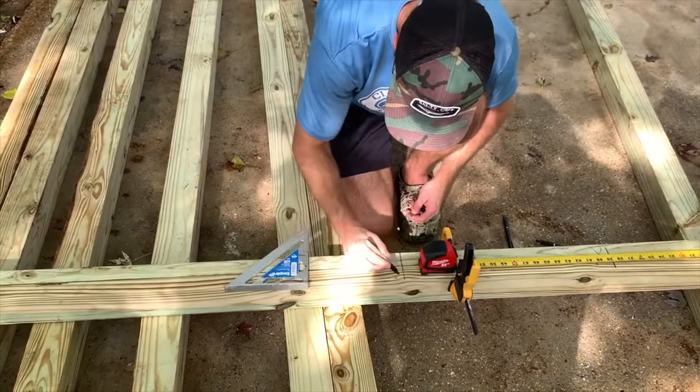What we're gonna do is take 1.5-inch PVC trim, and we're gonna trim around each window. But there's a little bit of a trick, and here is what I mean. Okay, so we're doing the windows now, and we're gonna do a 1/2-inch reveal. As you can see, I have a mark there, and then a mark there, and then I also marked down 1/2-inch. So we're gonna put our piece of trim up here, and you can see we're gonna move it up to where it's 1/2-inch down there, and that line corresponds with 1/2-inch overhang there. So we'll line it up on the top, and then we'll do the same thing on the bottom.